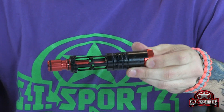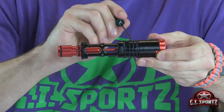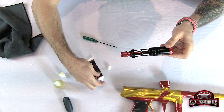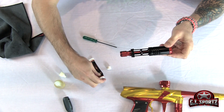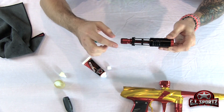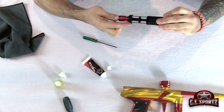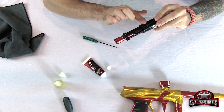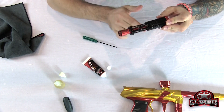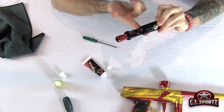Everything's closed up. Now we're going to take care of the stationary O-rings. Just put a little bit of grease on your finger and put a dollop on each one. Basically those O-rings are just there to seal everything up — they don't move. The reason we're lubricating them is so that the drivetrain slides into the body a lot easier and doesn't snag anything.